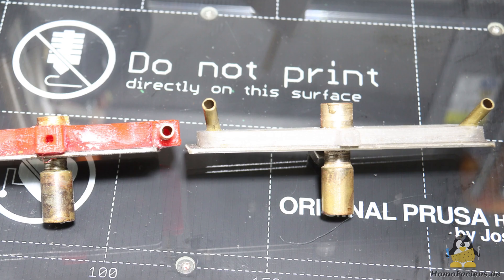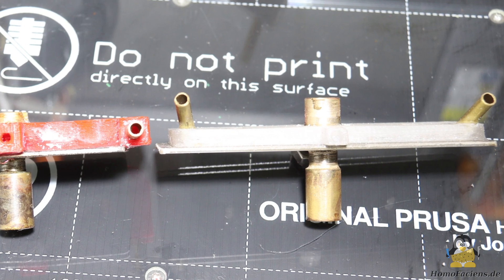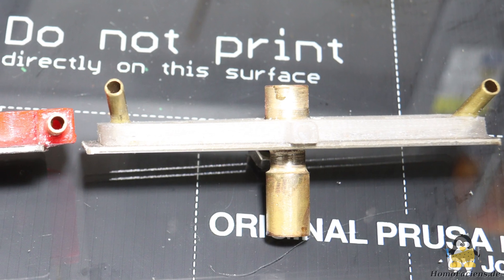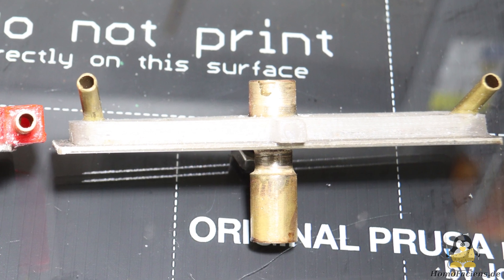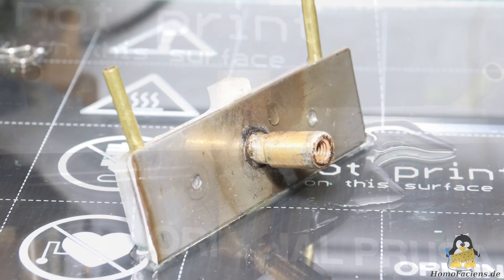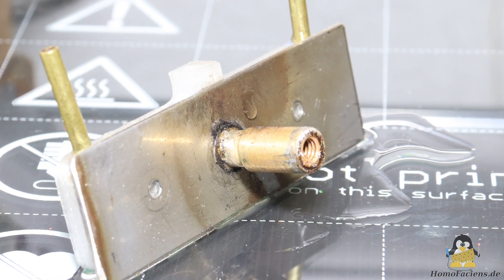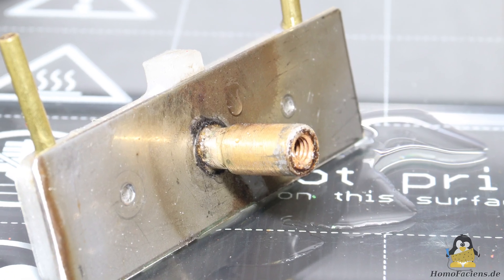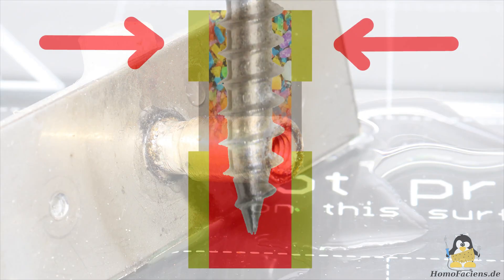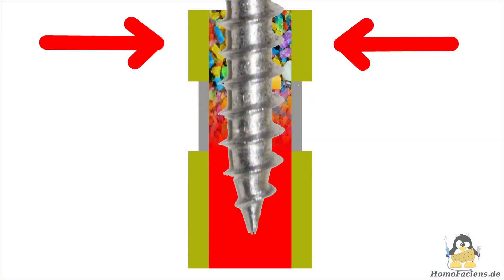Making the water cooling system flatter so that at least the cold end could be kept shorter didn't work as expected either. Extrusion creates very high friction even in the relatively small extruder tube. Models with a soft soldered connection between the tube and the metal plate of the water cooling system occasionally leaked because the solder joint cracked. The friction between screw and plastic generates a noticeable portion of heat even in the upper part of the tube — the cold end — which should actually be cold.